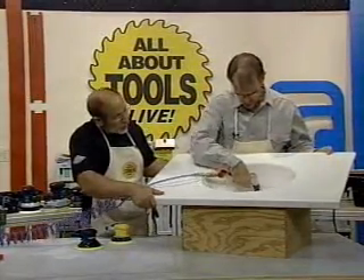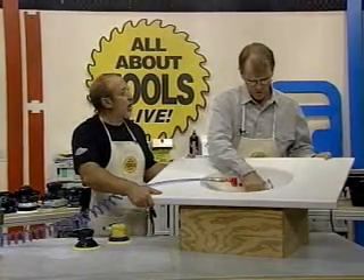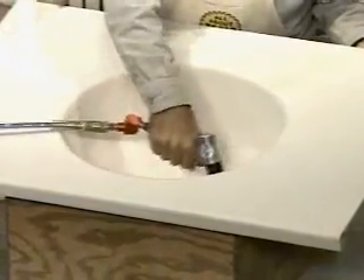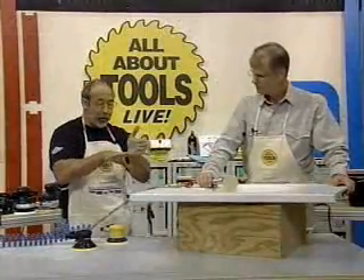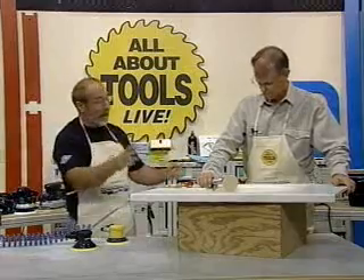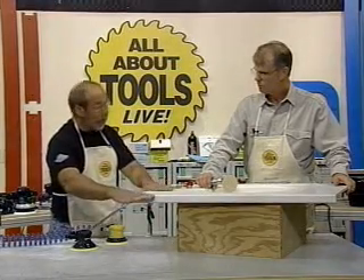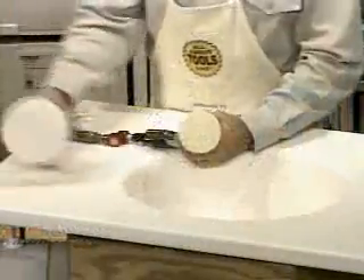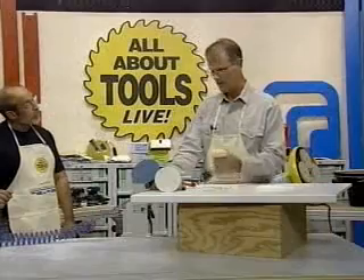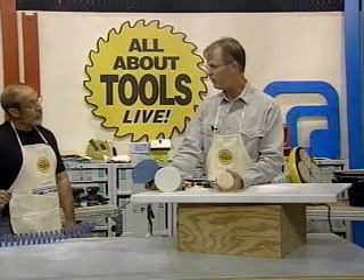Now, tipping this, all those corners which before were a little bit of a problem — it's nothing. This sander easily gets in there. There's no dust collection on this sander, so I'm using primitive dust collection — my nose! This is especially nice in a sink bowl where the bowl comes almost to a 90 with a tight radius. It can also be used for sanding into the corner of a cove backsplash, getting right into that inside corner. That's the real advantage of this small 3-inch radius pad — it reduces the diameter and lets it get in pretty tight, saving a lot of index finger work.